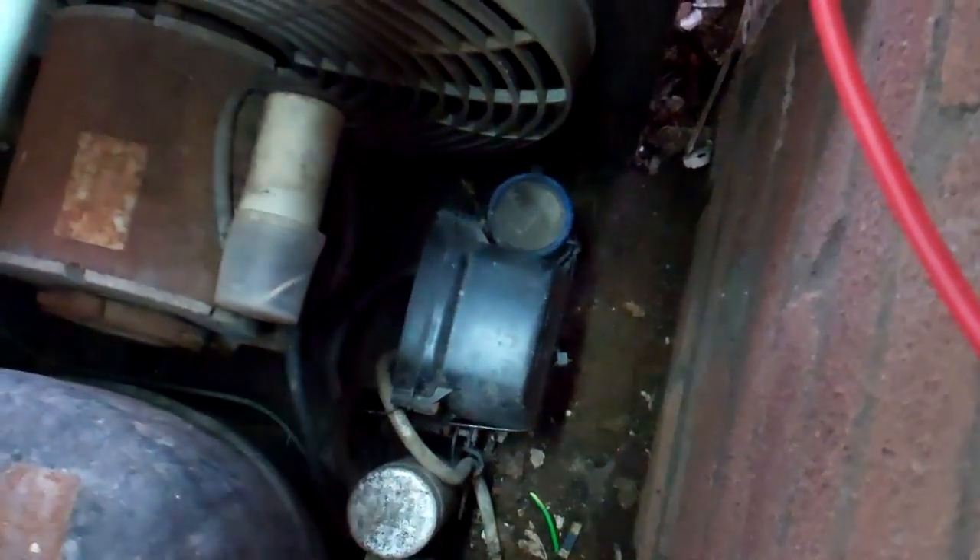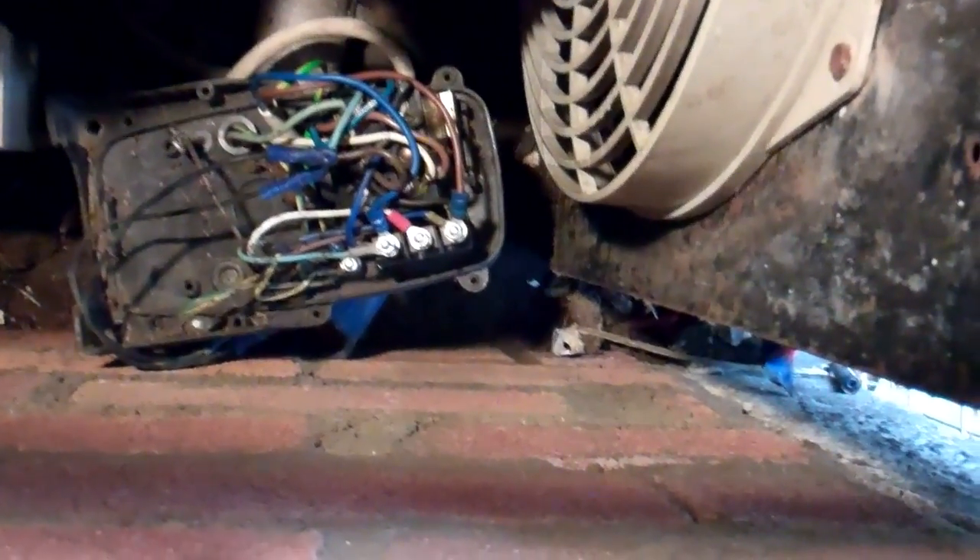So we're looking down there - there's a brick built pit. I think we're taking covers off. We've got the electrical box just connected and turned around so we can actually see into it. And I've done a little sketch - a relay, where the wires come in. So I'm going to have to take them off to test them individually. Always do a little drawing otherwise you'll be stuck trying to remember where they come from.